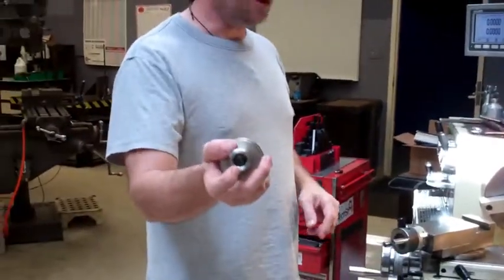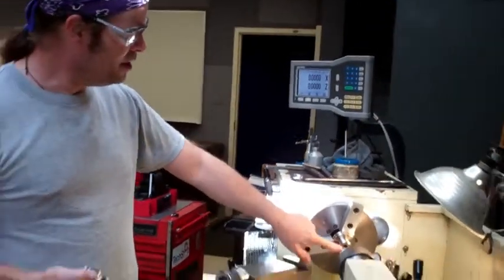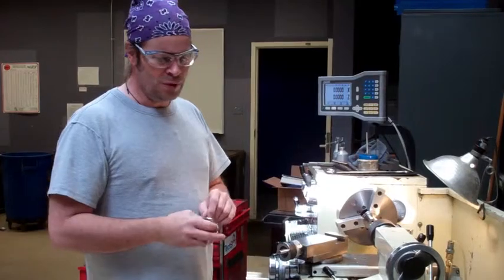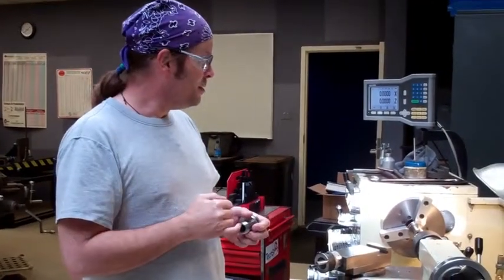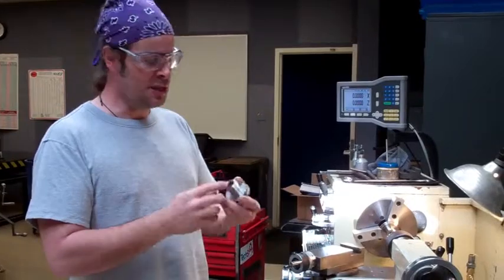So what I need to do is drill this hole. I've only got the pilot hole here because it's a fairly large drill, and it would chatter quite a lot if I just tried to drill it with the large drill. That also wears out a large drill, which is an expensive drill. So I can take a cheaper, smaller drill, and even though it's an extra step, it just makes things come out a lot better and a lot easier.